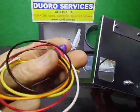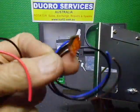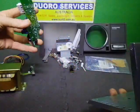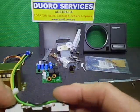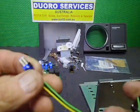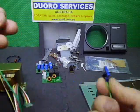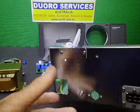All my wiring is plug-and-play using IDC plugs, so you can pull a PC board out with no major wiring hassle. The original boards just had wires going everywhere and they'd break. The direction switches no longer carry any load — they control two relays — so I've made them flying-lead as well, plugging into a colour-coded blue connector. You can physically take the front panel off and work on it, which was impossible before.